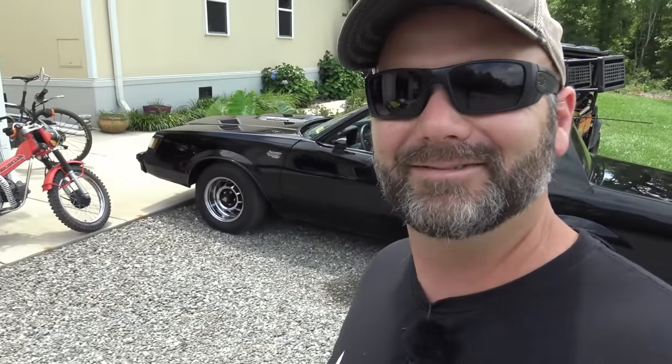So we're gonna let the tractor warm up a little bit, probably to about 110 or 115 degrees. That way the oil flows out nicely. The oil hasn't been changed in this tractor for probably 2 years, which means we're behind on it. We bought it about a year and a half ago, and it's only had about 50 hours on it since the oil change. Got some other cool toys here that we'll be working on the farm.